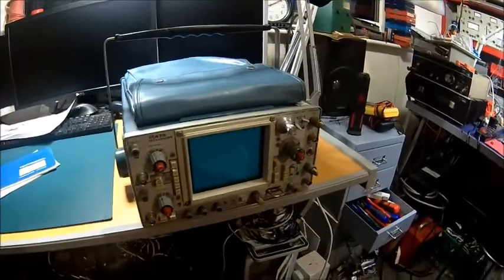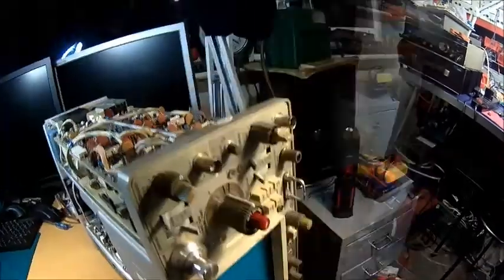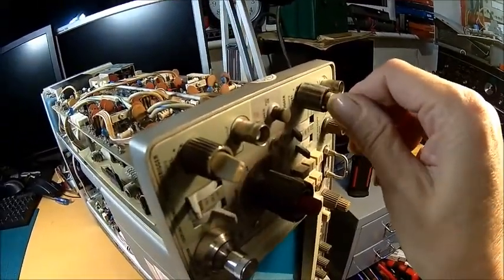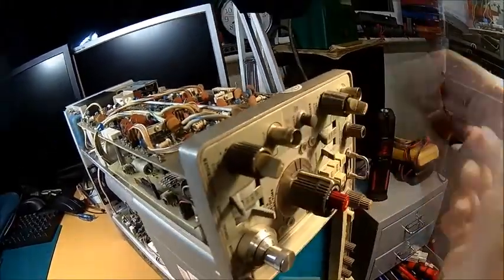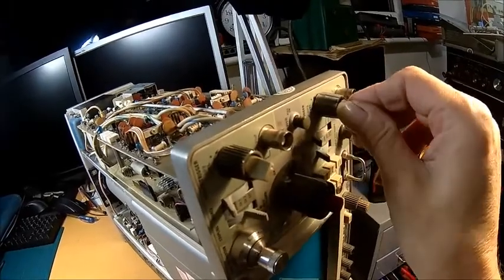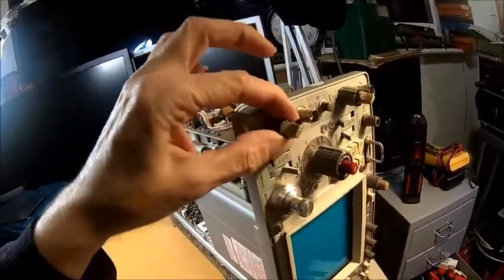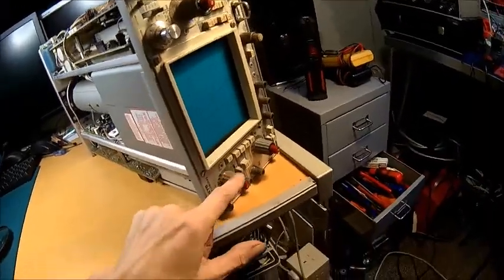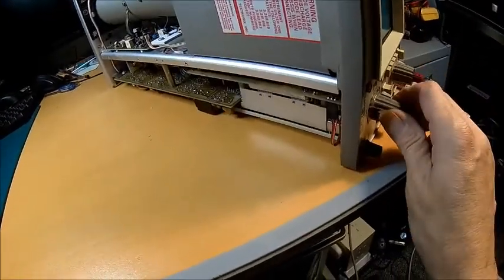Let's have a look inside this one and see what we find. The A-trigger slope switch is a bit odd. The pot seems to work, or worst case the shaft is binding — when you turn it, it changes the slope, but this is not straight anymore. This pot is a bit loose. So this has damage. Obviously these two knobs were 3D printed — not bad actually.